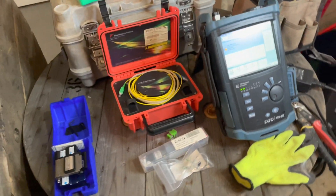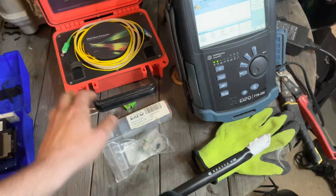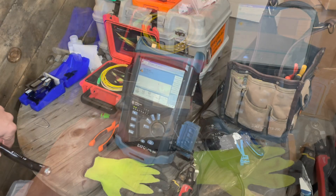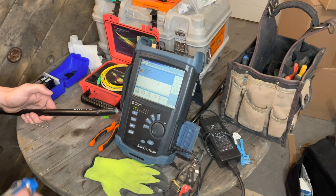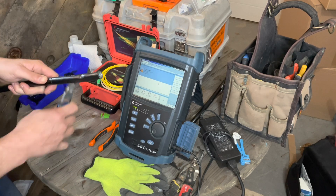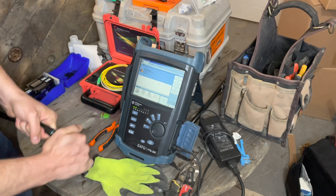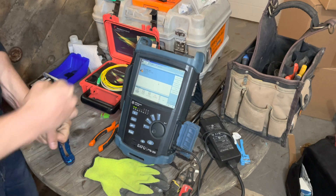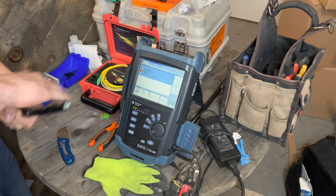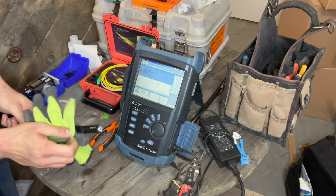Once you have that, come in here and get the end going. First thing we're gonna do — get the ring cut going, open this cable up a little bit. Do a nice ring cut around it, bend to the sides in a circular motion so you hear it crack that metal sheathing. Make sure it's cracked all around — it can be tough, throw a glove on.